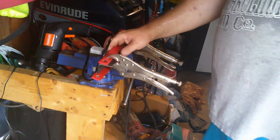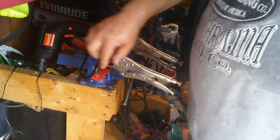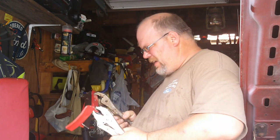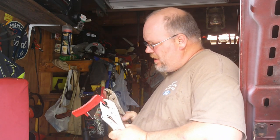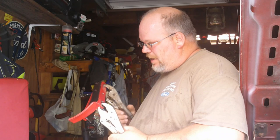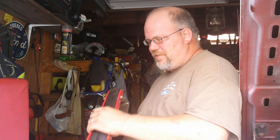It started to sprinkle so I moved inside. What I have here is one arm of a shoe with the angle iron facing the inside. Actually, I realized as I was editing the video — I've jacked this up. The flange just needs to face the inside, but I forgot about the pipe that comes across the top — we're going to hit that. So they need to be on the outside. If there's ever an issue with it racking, I could put a brace on it. I can still use all these holes — I just need to flip everything around.